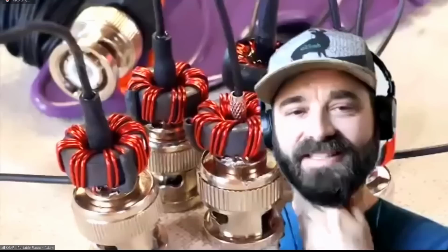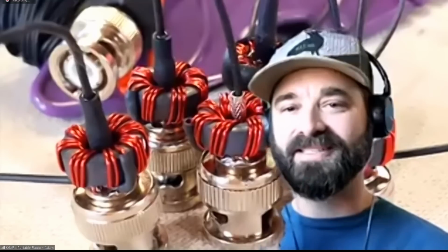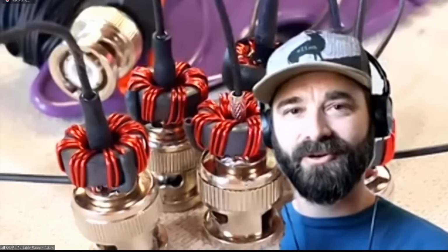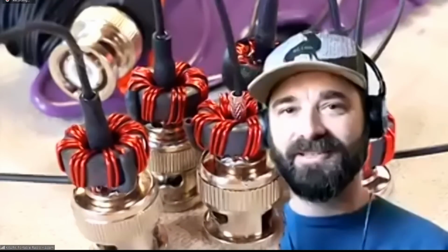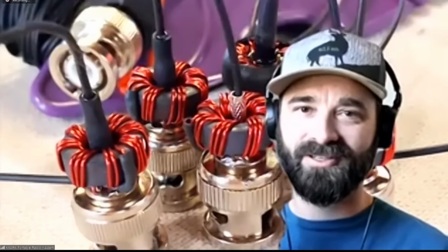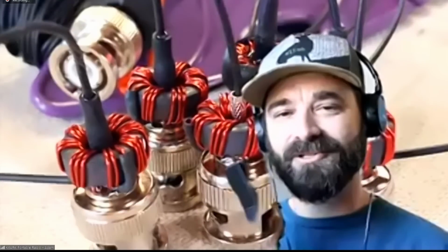Yeah, every antenna is a compromise, right? There is no perfect antenna, but the 160 full wave loop works. It works on 160, obviously. Works decently on 80 and 40. It's actually pretty darn good on 20 when you make it a square at that height, about 35 feet. You get a nice, relatively low angle of radiation in most directions. Some lobes, but not too bad. And I'm looking forward to that one. It should be a lot of fun.